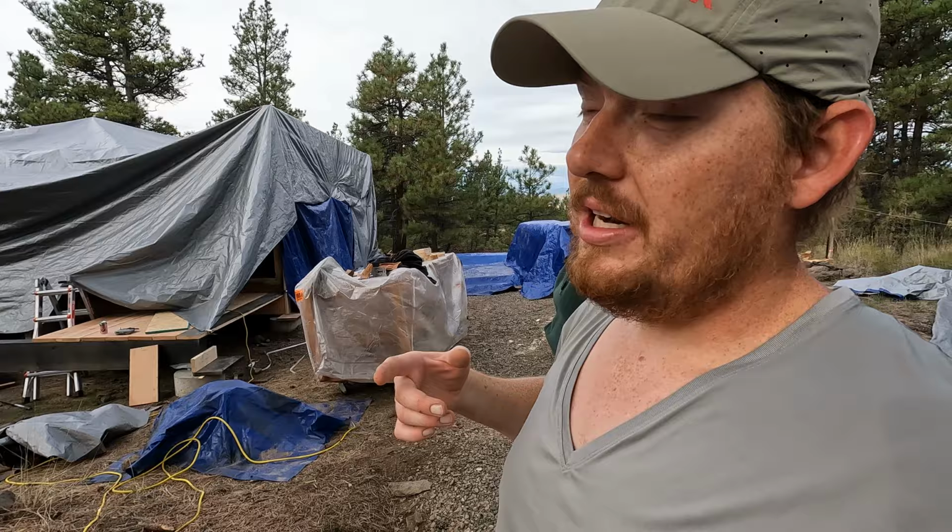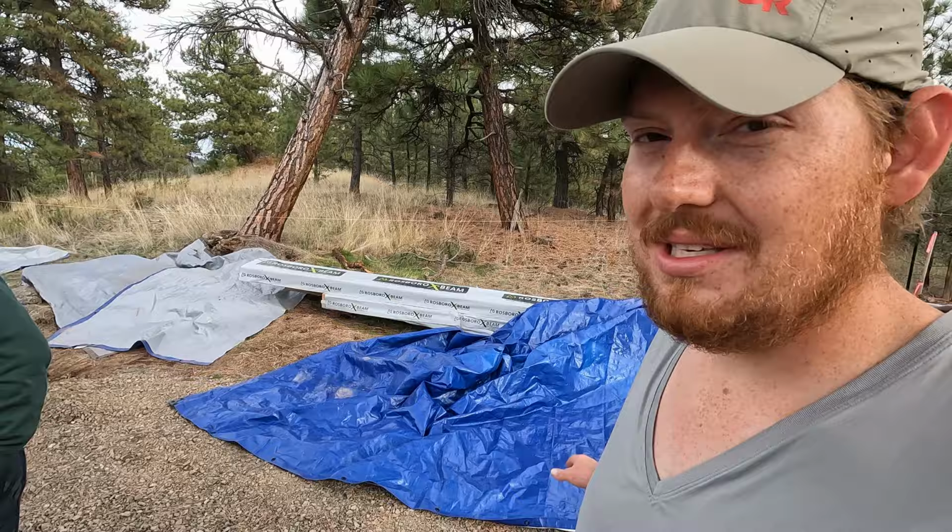It's supposed to rain for the next 2 to 3 days. So we're not gonna be messing with a whole lot of this besides the 2x6s. And we're just gonna get those moved into the building right there. We can cut, do whatever we need to inside the tarp, get this last wall stood up, get a load-bearing interior wall stood up, and then we can start setting I-joists. So we are doing well. We can work out of the weather now. This is starting to progress forward, so we're in a good spot. We just gotta get all this stuff covered up and protected from the rain.